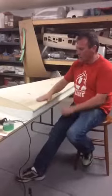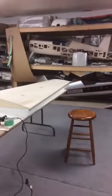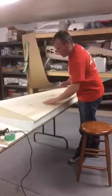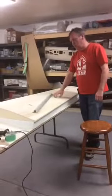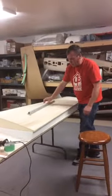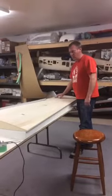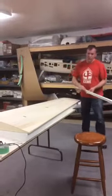Again, before I crack this loose, I do want to take a sander, a large bar, and you want to come through all of these sheets, and you want to just lightly skip them off. You want to get rid of all this glue, but don't sand too much. Remember, you're working with 1/16 sheeting, so don't sand too much. And also remember, if you have a big bar, this is straight. As you come up to here, this is your crown. This is where you need to start straightening up. So I will sand these off with an orbital, and then I'm going to come back through with a long bar, give it a last skiff, and work in my leading and trailing edges.